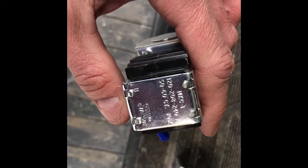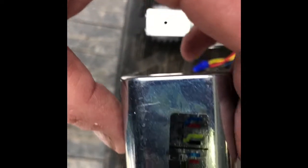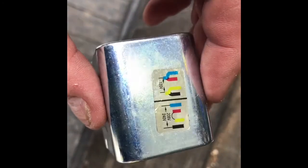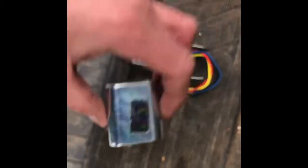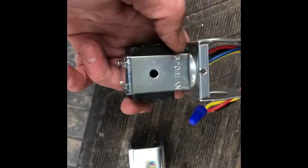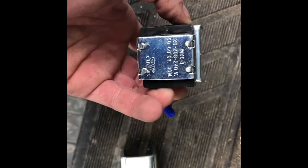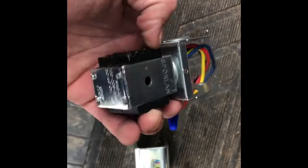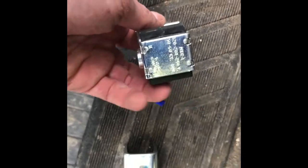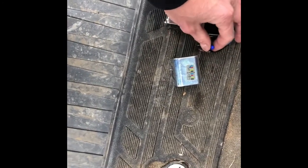As with the case with this particular coil, this is a Sporlan MKC1. It's dual voltage — you can wire it for 120 or 230. They usually come with a little diagram. You can see right here: 208/240, red and yellow have to be together, black and blue are your lines. You just wire it together like that. If they're wired wrong and you bring 230 to a 120, you're going to cook the valve. We've seen it happen — these things will melt right up. Wired wrong by electricians or from the factory and nobody checked. So these dual voltage ones we use a lot. You can get regular 120 or 230 ones, but the dual voltage are good, especially in a bind because you can use them pretty much anywhere.